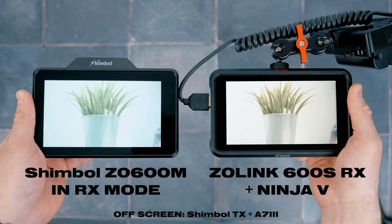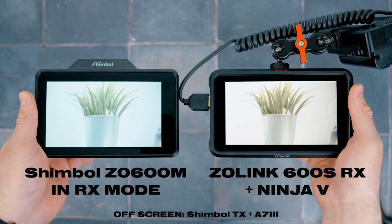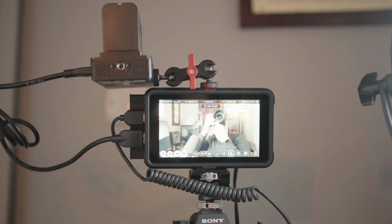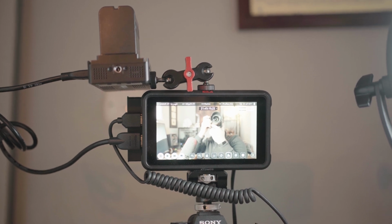So earlier I mentioned that if you have your setup like mine with the transmitter on top of the camera and then the monitor set as a receiver, then with the 600S kit you actually have an extra receiver left. You could just keep this in a box and not bother using it, or you could plug this into another monitor and have yet another wireless screen. So what you could do is just plug it into any kind of TV, monitor, whatever, and then you can look at your footage on yet another screen. So based on how I have this system now, I've got my Ninja 5 on top of the camera with the transmitter, I've got the wireless monitor here, and then I could have another wireless monitor. That means you could have one screen for the director to look at, one screen for the FX people to look at, or whatever kind of setup you want.